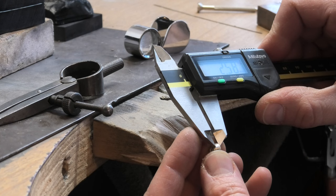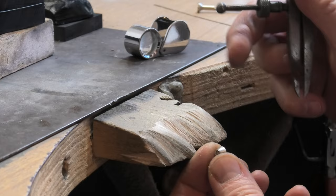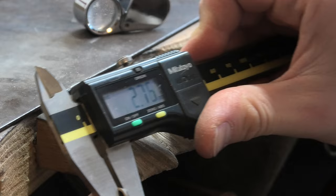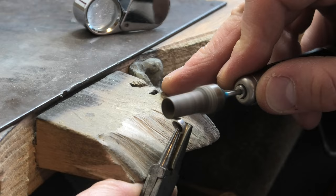Having a nice flat top, I can choose a measurement. I'm going to cut off the bottom half here because what we just made doesn't need to be deep at all. 2.6mm - I think it looks good. Now that the top is flat and nice, I can use that as a guide for dividers. So I just set these to the little line I drew - the measurement isn't important, it's just what I like the look of. I left it above my line to 2.75mm. I'm going to get it cleaned up now and then we're going to start chopping this up.